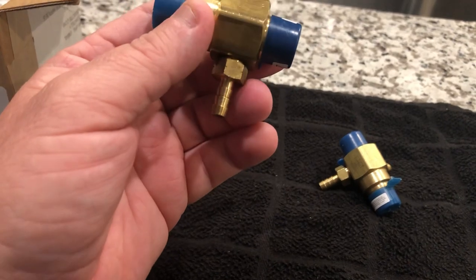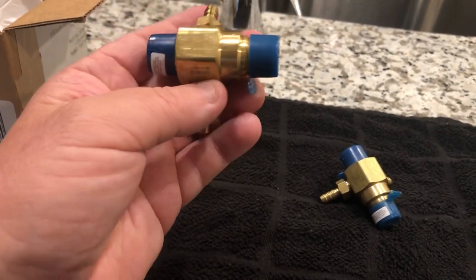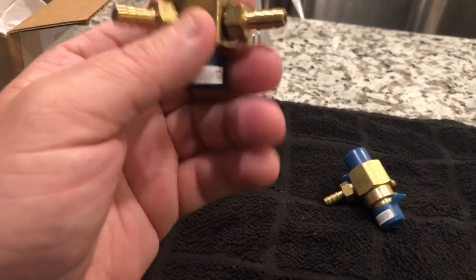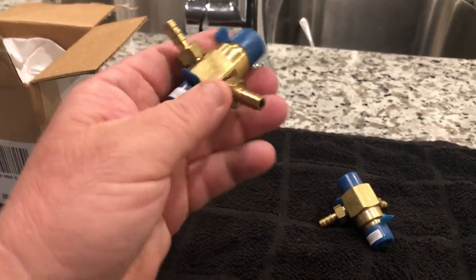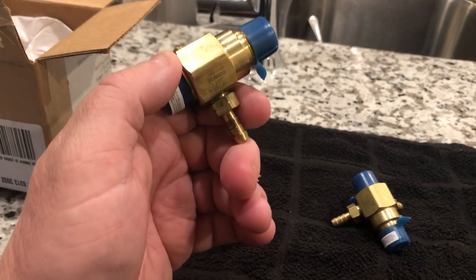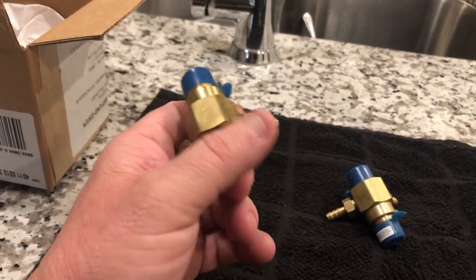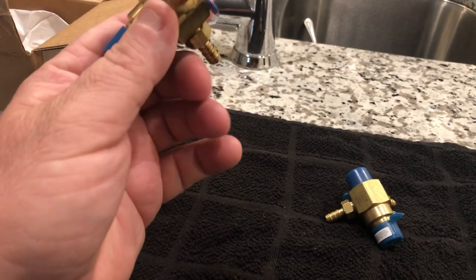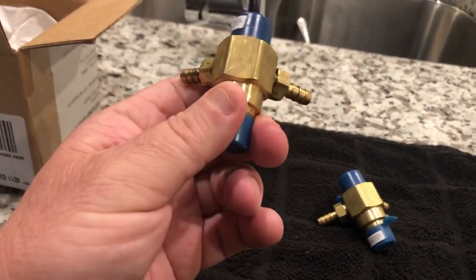What I like to do if y'all are into downstream injecting — I don't run my machine at 100% power when I'm downstream injecting. Our flow rate on an 8-gallon-per-minute machine — with our downstream tips it's actually 10 gallons a minute — these are only rated for 8 gallons a minute, so we're going to be over-diluting our ratio. What I like to do is pull mine back to about 60%, maybe 70%. You can still shoot something 45 to 50 feet away in low wind conditions even on 60% power. So 60% power on a 10-gallon-per-minute machine gives you about 6 gallons a minute. This is rated for 8, so you're still going to get your draw rate probably around that 30%, but you're going to have less dilution — so we might achieve 4%. That's the goal.